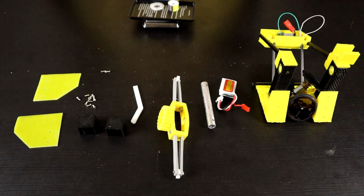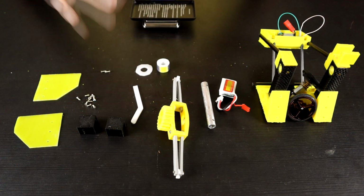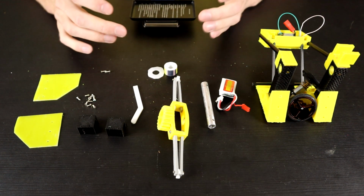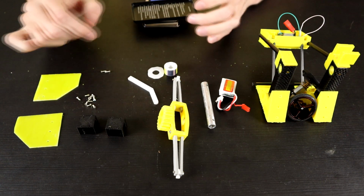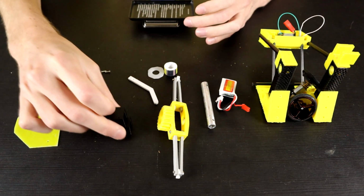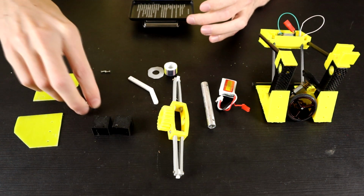Let's take a look at our spacers. Now, spacers are 2 grams between the two of them. I don't think we need to really worry about changing those up. Anything we do is probably actually going to add more mass. Our little standoff, less than a gram, that's 0.89 grams, so that again is something that we shouldn't really be touching on. The motor mounts we've looked at before at 6 grams, we can change these over if we want to.